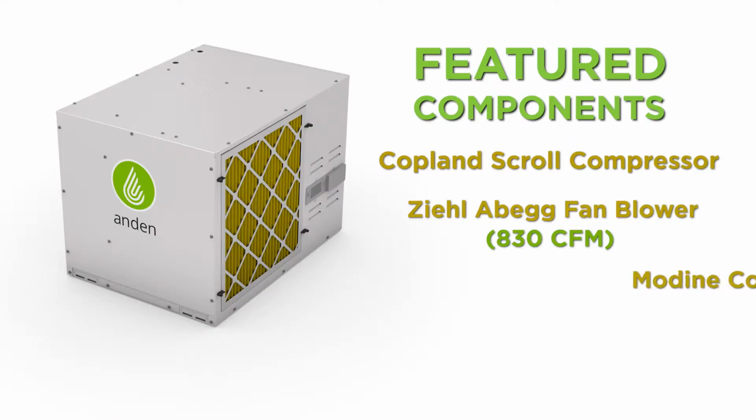We also use Modine for our coil. One of the nice things with Modine is they have an Electrofin coating that they put on there for corrosion resistance. Electrofin coating coats that coil and all those fins really evenly and gets down into all the little nooks and crannies, so we get a good even coating for corrosion resistance, and it also helps with performance.